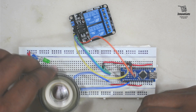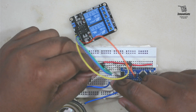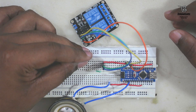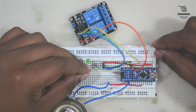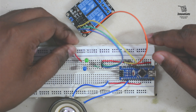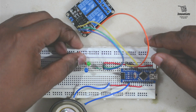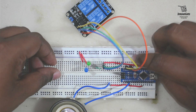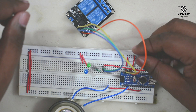Now I need to connect the two LEDs — these will also be connected with pin number 13, so I am connecting a resistor from pin number 13. These two LEDs will be connected in reverse polarity: the positive side of one LED will be connected to the resistor and the negative side of one LED will be connected to the resistor. One pin of each LED will be connected to positive power supply and the other to the negative power supply. I'm moving these two to the upper side so we can connect them to the power rail — connecting the negative and then the positive.